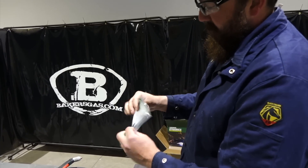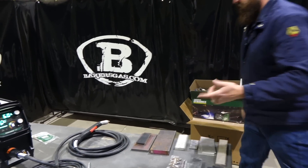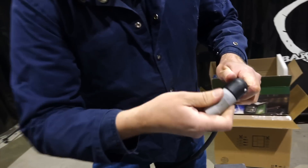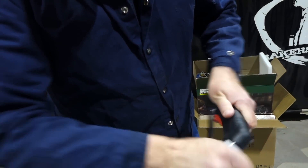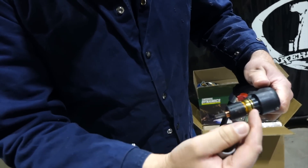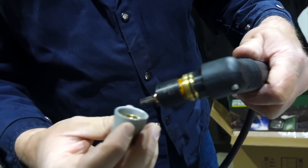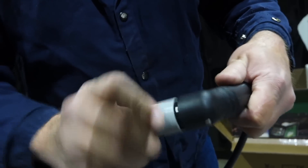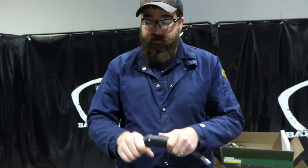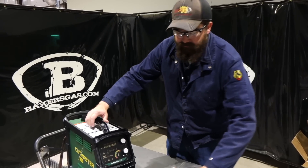If you're not familiar with what the O-rings are and all that, we'll break down the torch for you. Generally people don't know why it comes with lube and O-rings. On the back of this torch, there's a little O-ring. Every time you change out consumables, you should put a dab of lube on there, run it around, and then screw that back on. It just helps extend the life of that thread pattern and the O-ring. So I've got the torch hooked up and everything and went through the consumables.